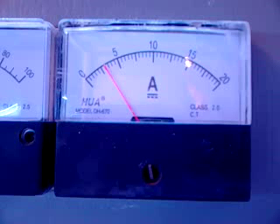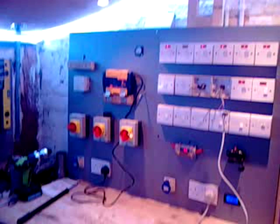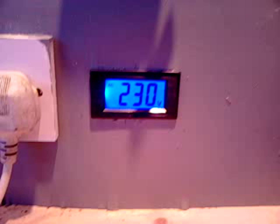Even though we are putting in seven amps, we are full and we are pulling about two and a half, maybe three amps. We're running purely off the generator now. Voltage is quite stable — 230 volts. That's quite handy. Ventilation's going, and the wall is sealed up so you can't really hear it.